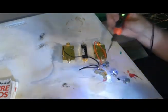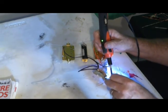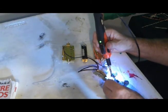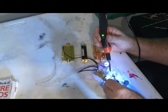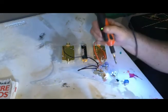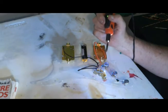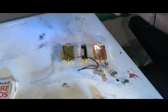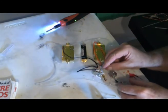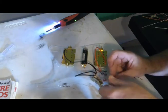As I said, this stranded wire is so hard to work with. It cools faster than everything else, so the solder doesn't like to stick to it. I was reading one tutorial about how to do this, and it said don't fill the lug with solder. And I said, why? That makes it much easier for it to grab onto the wire if it's grabbing it from all sides. So whenever possible, I violate that rule. And I make no apologies, because I soldered good.